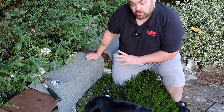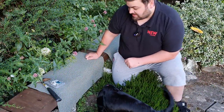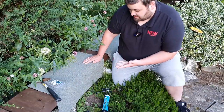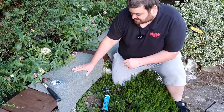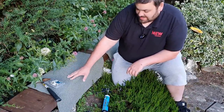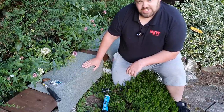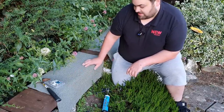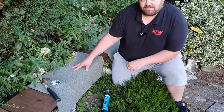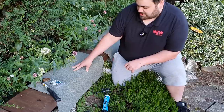So once the woodwork's all laid, it's then time to move on to the felt top. Now, for this, I can use a multitude of things, but I've decided to use shed roof felt. Now, the best colour I've seen is actually this stuff, which looks very grey and very ballast-like on top, but it's actually green, so you have to be very careful, particularly if you're ordering it online, as to which colours you go for.